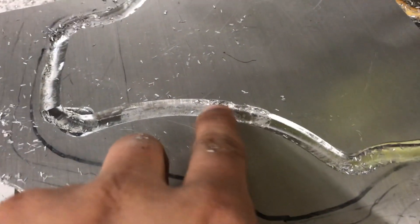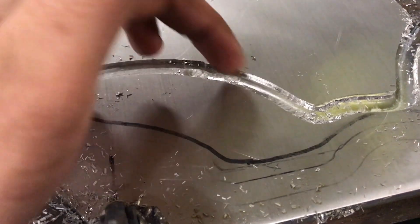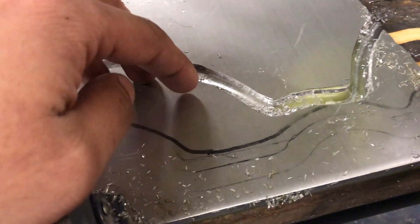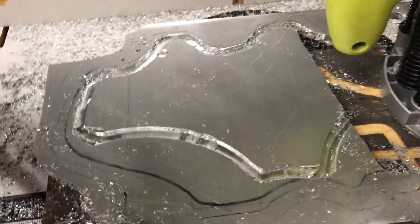Quick update on an issue I just ran into. It's all messy — what happened is that since aluminum is so soft, when it gets hot it likes to bunch up. This is why you need cutting fluid — mainly to cool and lubricate. The aluminum bunched up on the blade down here like a little ball, meaning the blade wasn't cutting anymore. I figured that out, stopped, cleaned it off, and added more PB Blaster, which I'm using as cutting fluid. It's an oily cooling liquid — WD-40 works too. There are specific cutting fluids, but PB Blaster works perfectly.